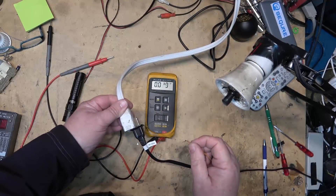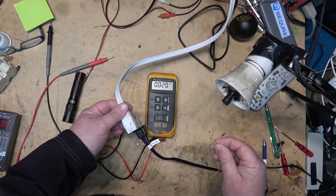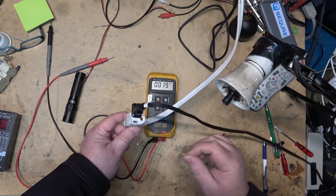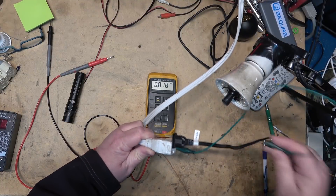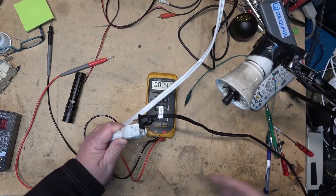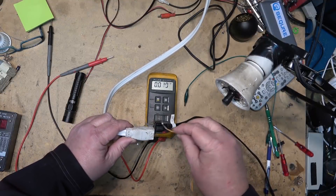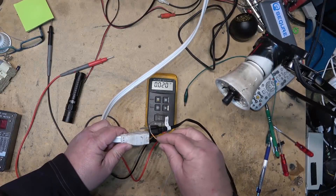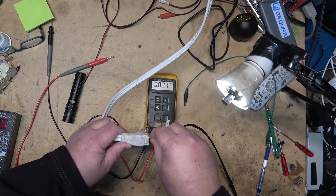It's maybe not quite as bright as plugging it in directly because this is an indirect ground, only about a foot long into soil. If I were to drive a six-foot ground rod with heavier wire we'd have a good ground. With a jumper to the house ground we get full brightness, because the house has a ground plate electrode. My test ground is just a screwdriver driven into gravel about eight or nine inches — not ideal, but there is a ground there.